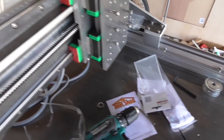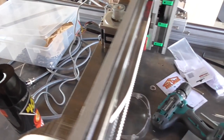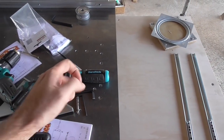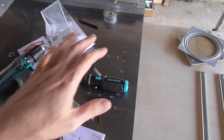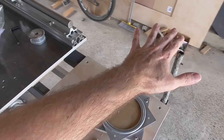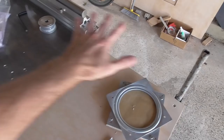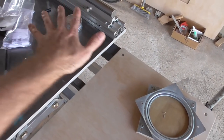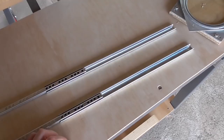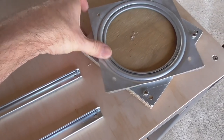The reason I want to bring it here is because when the gantry is further down and I'm trying to adjust something I'll probably be using the keyboard. I'm also thinking about maybe making a Bluetooth game controller for it, so if that happens I won't be using the keyboard so much. The problem is we want it to move to and fro in this direction distance-wise, but also rotate - in Box2D parlance that would be a prismatic joint and a revolute joint. One way to do that is with a lazy susan and drawer slides, but I don't think that's going to be strong enough.